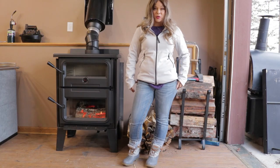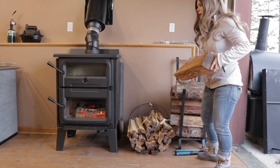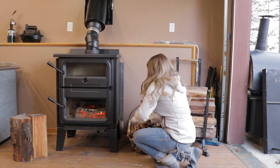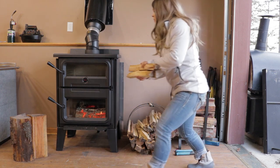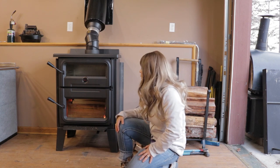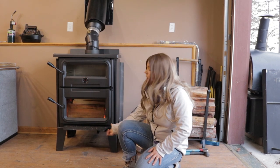We're going to head into our final hot burn right now. I'm going to grab a few more logs. We have now been burning about six hours. I want to get the firebox really full. I'm going to add in a few more pieces of kindling to complete the firebox as I stack it up. On my final hot burn, I'm going to let it go about 20 minutes or so wide open to get it nice and hot. I'll give some temperature readings, and then after that I'm going to damper the stove down to see what kind of burn time we're going to get out of the unit.